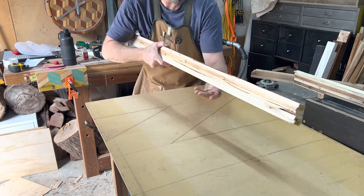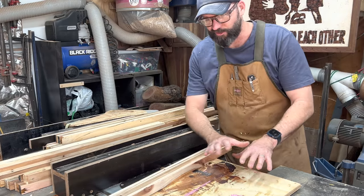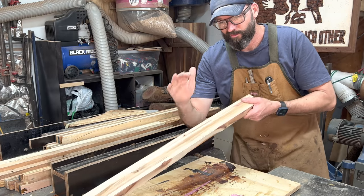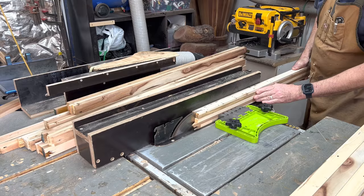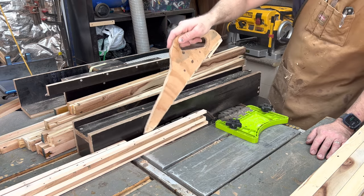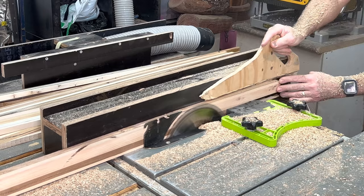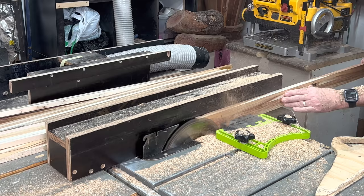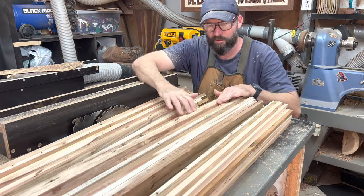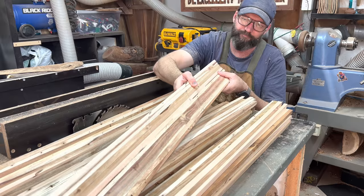Stand by for a montage. The best way to maximize this timber is to rip it down the middle and you double your stock. You can then glue it onto some dodgy board that you might find out the back dumpster, and then you've got yourself some nice stock with your nice decorative timber up top. Stock doubled. I do understand that every time you run this through this saw, you're losing stock, but it's worth it.